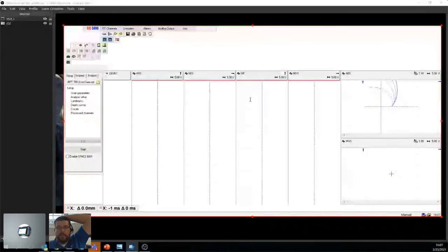So that's fine. Now the next thing is, what do you want to see? Do you want to see all your differential channels? Yes, I do. Absolute, definitely. And would you like a mix? Yes, I would like a mix. I would like to keep the F90, well, D90, so the F90 but differential channel, and I want to subtract the F90 divided by 2 differential channel. So this is what I'm looking at. The reason I'm taking the 90 divided by 2 is simple. That has more penetration, right? Because the eddy current penetrates deeper into the material, it allows me to see the support plates better, and therefore an easier way to remove them from the mix channel.